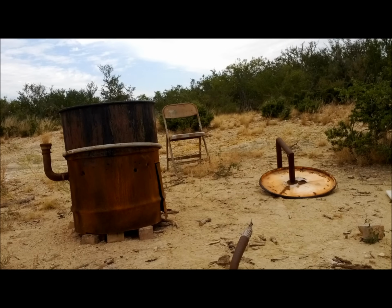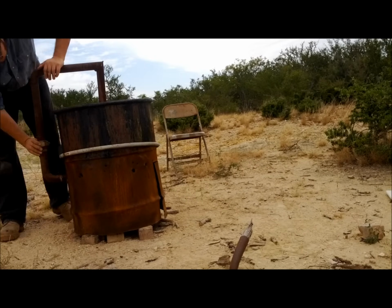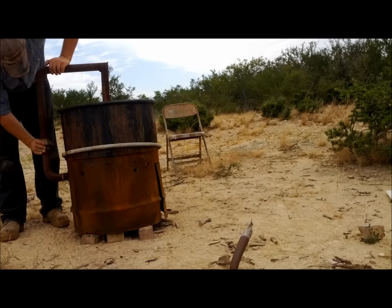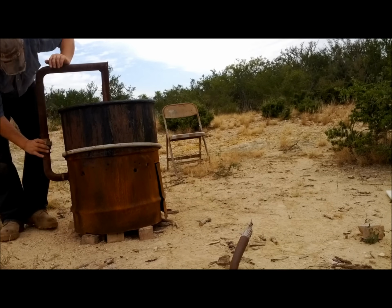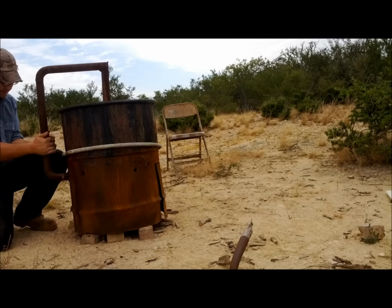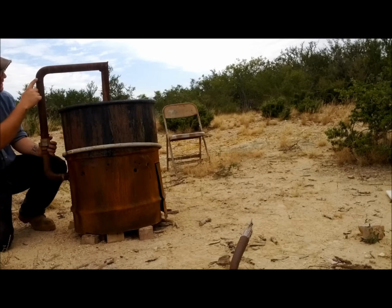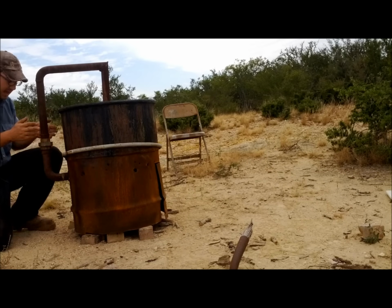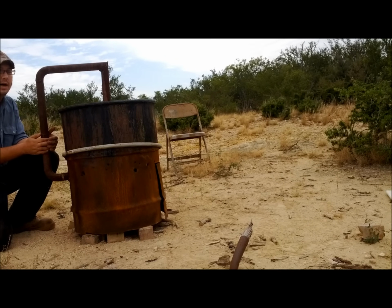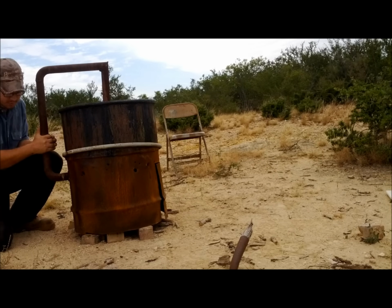And now, I'm going to seal the whole thing back up. It is important that the whole thing be airtight because we're depending upon a gaseous transfer here. So it has to be tight enough that we don't have smoke and gas and steam escaping from this union. Had I built it according to the instructions provided by, I believe it's Two Rivers Forge, I wouldn't have this union here and I'd have a much larger cavity. But I built this when I had more limited space. I'll be upgrading pretty soon.